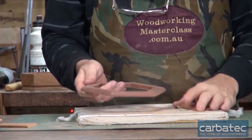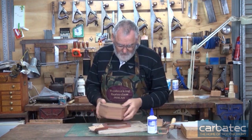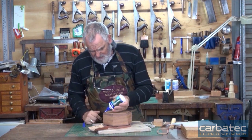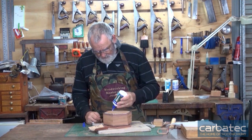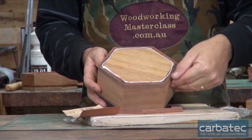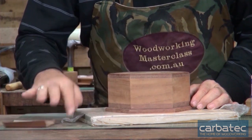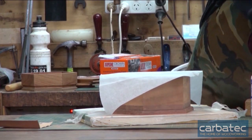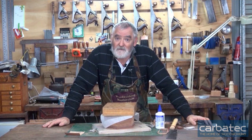So that's all nice and clean, no sharp edges, nice and flat, rounded over. Use a bit of PVA on this - could use hide glue but where it's not going to show, creep really doesn't matter as far as I'm concerned. But I make sure that glue line is nowhere near the edge so it's not going to squeeze out. What I want is all these edges to line up with the joins in the stand. I'll just leave that, put a weight on the top, and come back when the glue's set and the flock should be set - then we're finished.